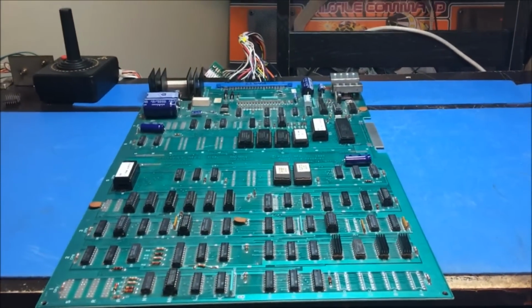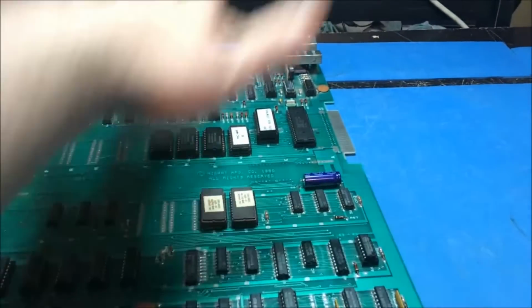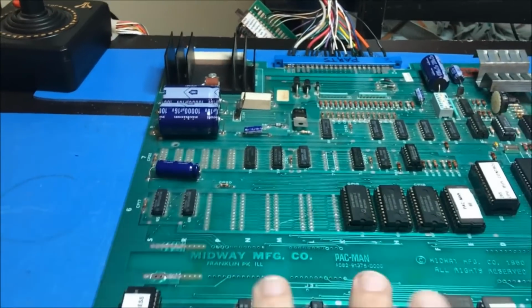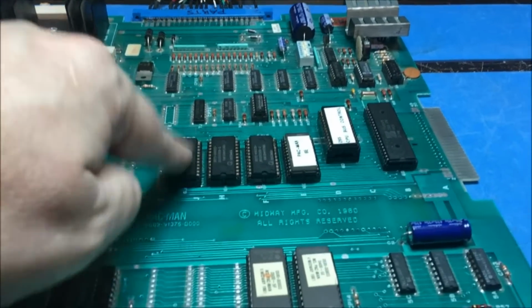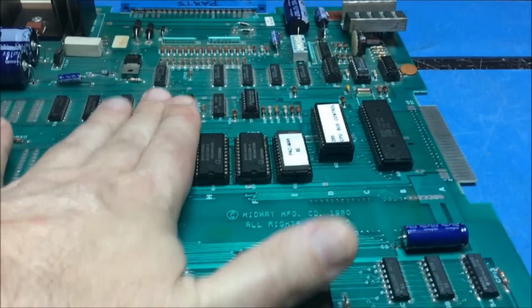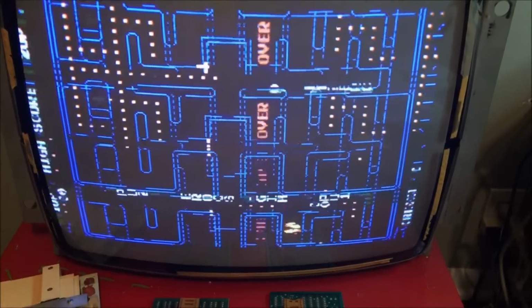Okay, well, if you remember, this was giving me a bit 7, address bit 7 decoding error. And so I just decided to probe some address lines with the oscilloscope up here, and over here where they're buffered out, bit 7 was floating. There was a broken trace right at this chip. So I had to remove this socket, fix the trace, and put the socket back in and fire it up, and it has decided to start working somewhat,